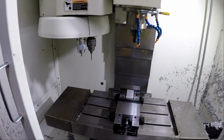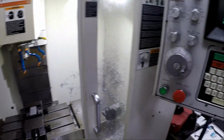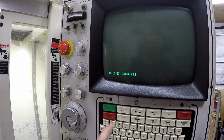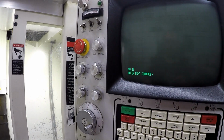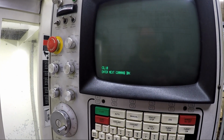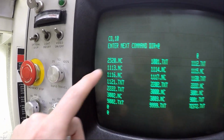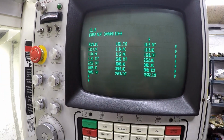Alrighty guys, if you follow me on Instagram, you've already got a sneak peek of this, but we're going to do it for our YouTube friends. We're going to go over here, go to CD 10, to get those FTP files. CD 10. Then we'll go to directory. We'll make sure that our program's in there. Oh yeah, see, 2520, our quarter 20 rigid tap test.